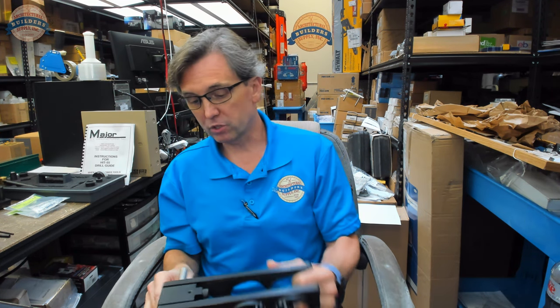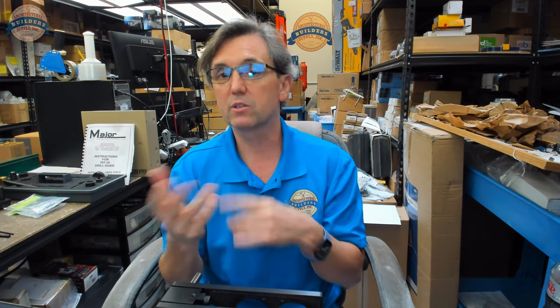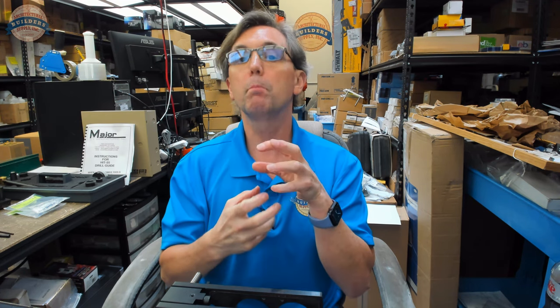That edge bore is right in the center of the thickness of the door, and everything needs to be stretched out for that. When it's unequally extended, that's when you need to think about mortise locks, what parts need to go into there. Cylindrical locks, again, the factory's going to build that lock.